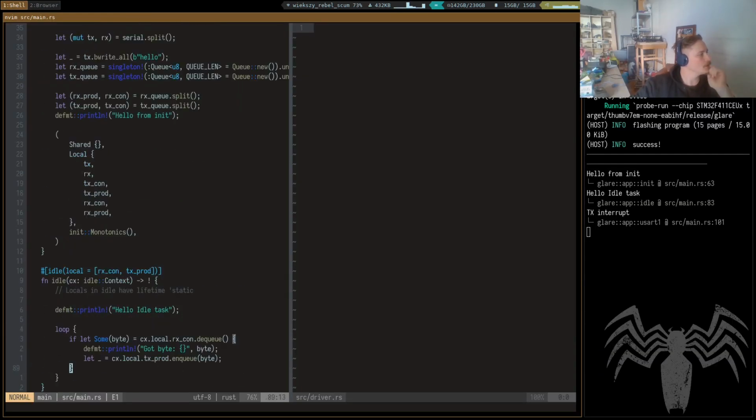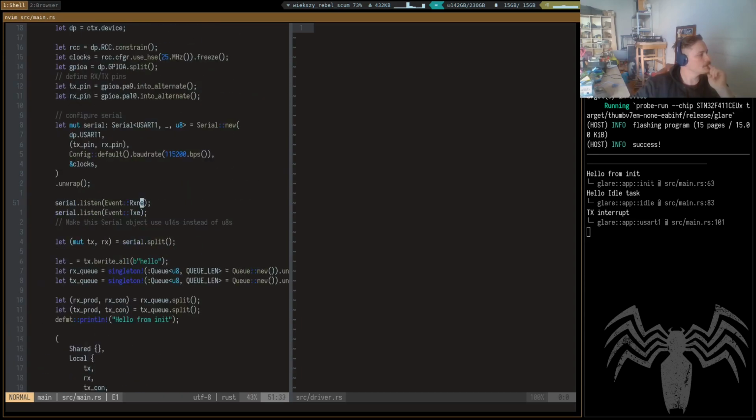So in here, instead of the transmit, is the idle event. So we will basically listen for the idle line, which will tell us that all of the bytes have been sent. And then we're ready to assemble it and provide the full output.